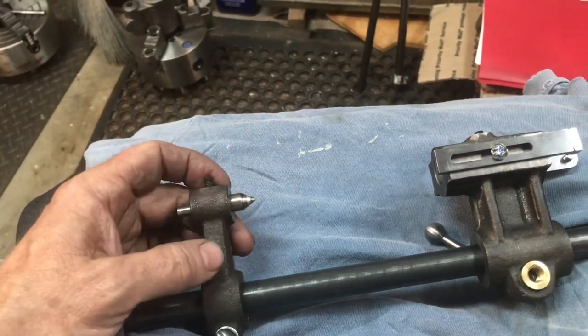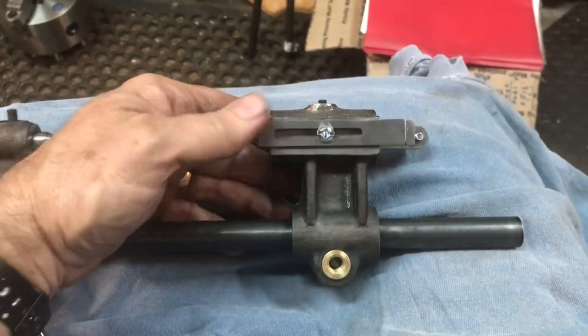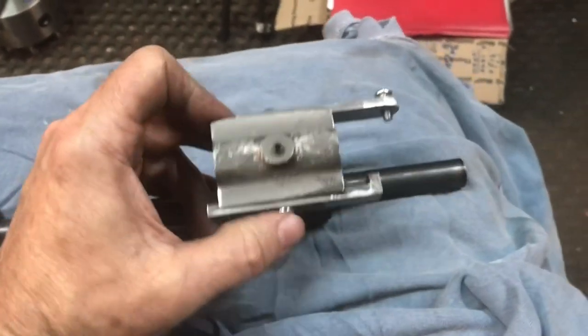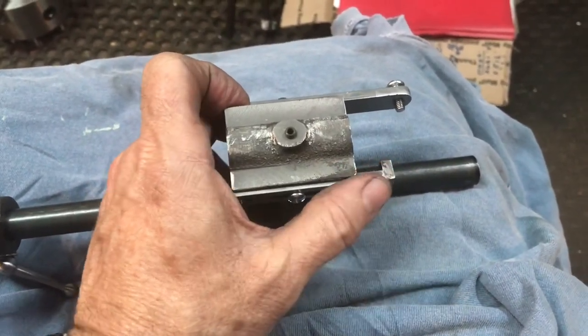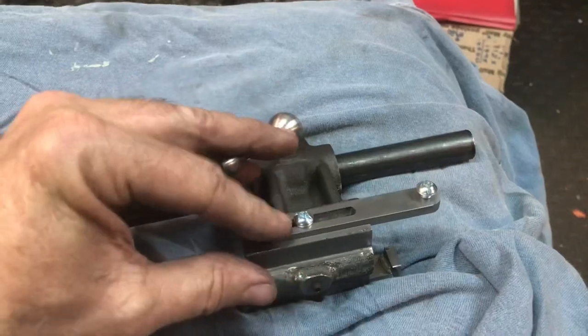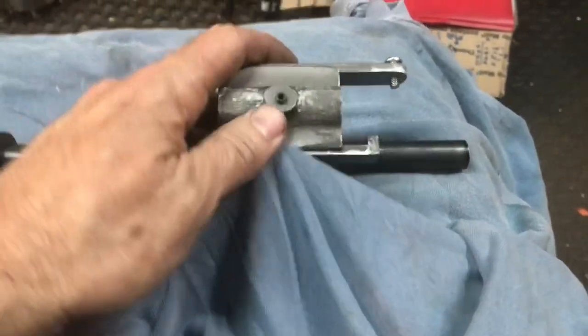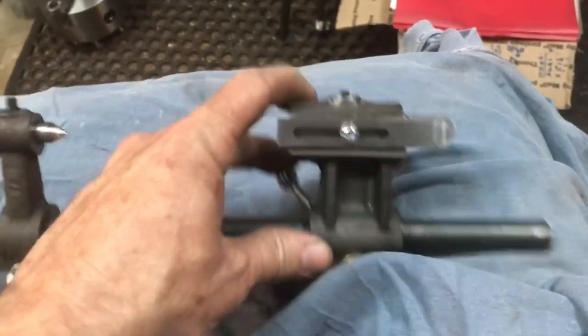Inside is just an old center I had that was the right size. The final segment covers making the guide bars — I hadn't covered that before. I silver soldered one together; it has a little L-shape in it. The other was a simple matter of milling, drilling, sanding, and tapping 10-32.